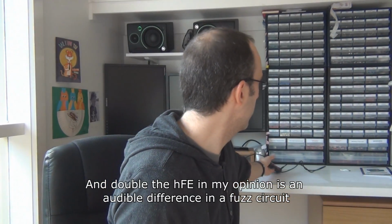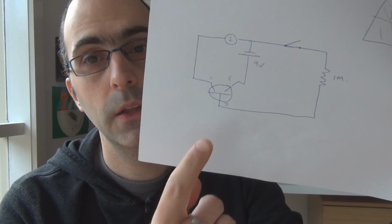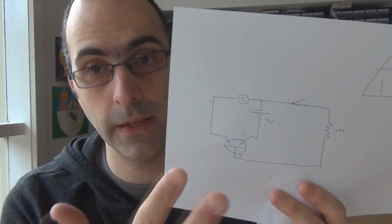So what we'd need to do to simulate the Small Bear test is to try and get approximately 9 microamp on the base, and then take our measurement, which is relatively simple to do with the curve tracing ability of the DCA. That's one of the reasons why I think the DCA75 kicks ass, because you can do that. It can do a lot of different things like that.